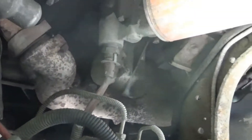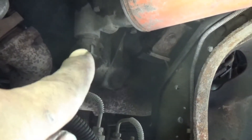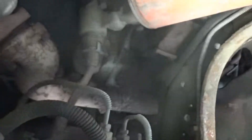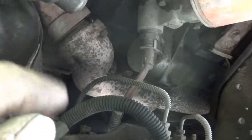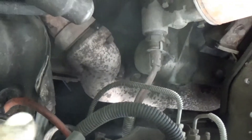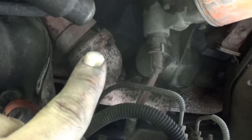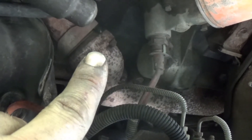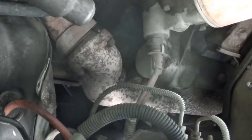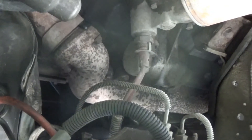Now we're under the truck on the driver's side. You can see the oil cooler right back there, the block heater, the oil filter, the exhaust manifold, and there's the start of the up-pipe. This is a manual, so there's your slave cylinder on the side of the transmission. We're going to drill a hole right under my fingertip there — probably right down about there. It's a fairly flat, even area, so getting a drill bit there shouldn't be a problem.